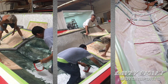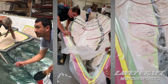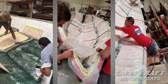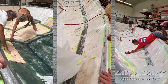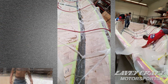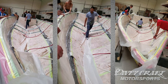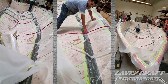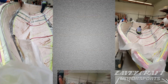Years ago, the process was done by hand. If you've got a 30-foot boat — all the keel, all the V, the side, the transom — were all done by hand. Great process, but we've basically stepped it up a notch. By doing it by hand, you're wetting the material out and essentially rolling with a very heavy duty roller. But if you've got four or five guys from tip to tail, the equal pressure is not there.